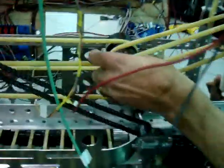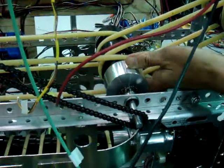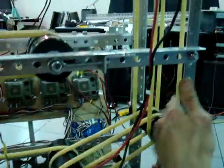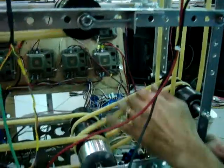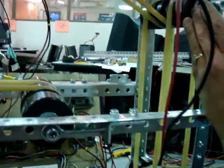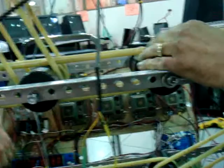When we switched over to the latex tubing, that could go around a tighter diameter drum. So on the side here, we used to have an aluminum arc that the ball would go around, but it did a poor job of it. So we switched to latex on here. And since the latex could go around a smaller diameter drum, these are smaller diameter. If we were to redo everything from scratch, these could all be smaller diameter too.